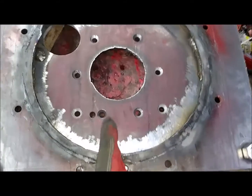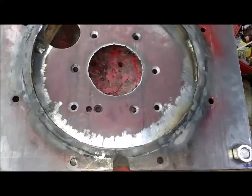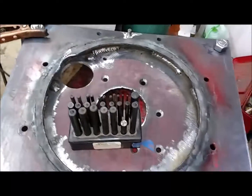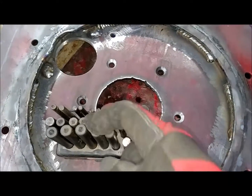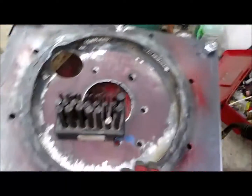I found my center, used a square to do my pin holes, and once I got those done I could pin it to the housing and use transfer punches — these cool little guys, real handy. They fit the various hole sizes and give you a little center punch mark dead center. I just used that to get the rest of the bolt circle done. That's just a plasma cut by hand.